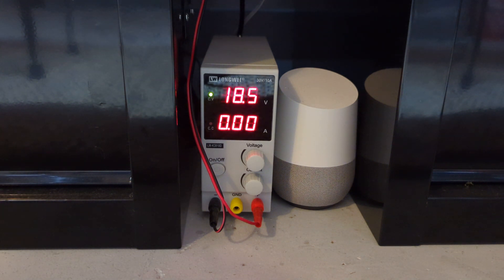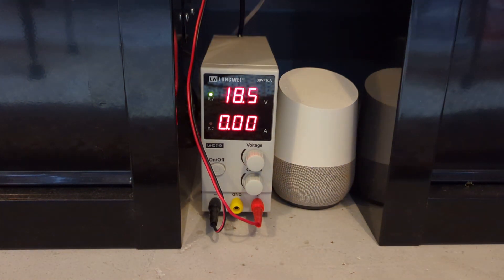Let's take a look at a Magna Traction car. This is a 12-ohm standard red wire Magna Traction car. You can see it draws a little bit more current — 0.3 amps — which is starting to get a little lower resistance on the armature, but it would still probably work fine with a standard wall plug. This is a Mean Green 6-ohm armature Magna Traction car, and it's drawing a little bit more current, getting up close to half an amp.